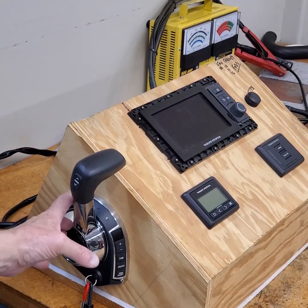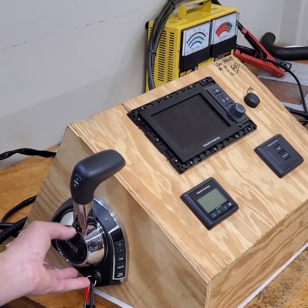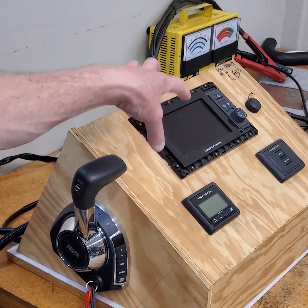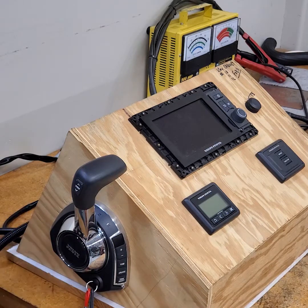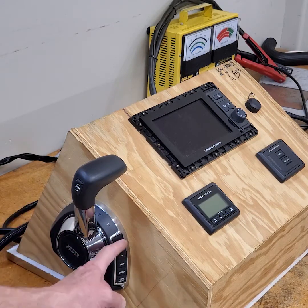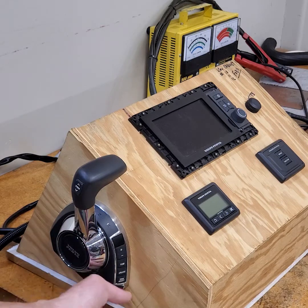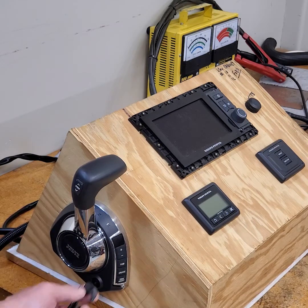This is an EVC control, so there's a node behind this that's part of it. The installation is the same idea as a standard top mount control — there's three screws and a cutout. You basically cut it out on the side of the hull, put your insert in, screw or bolt the insert in, slide this in place, put in the three screws, and put your plastic cover on. It has an emergency lanyard already factored into it.